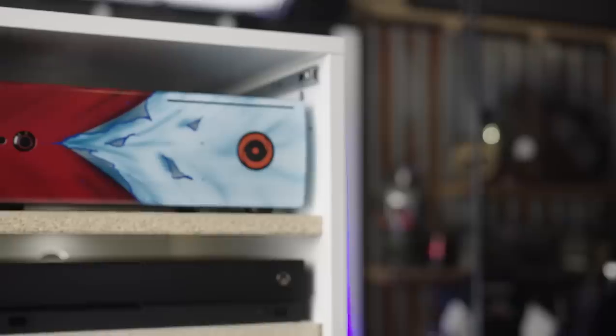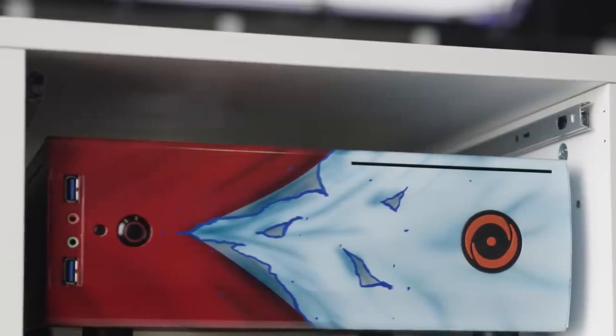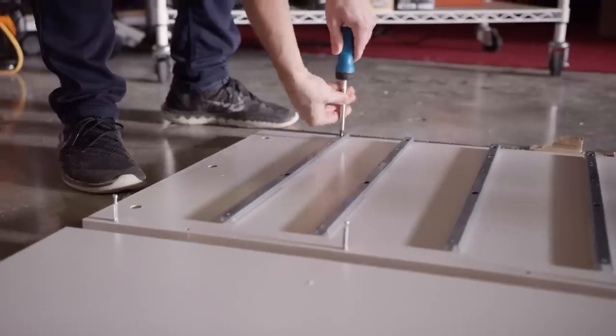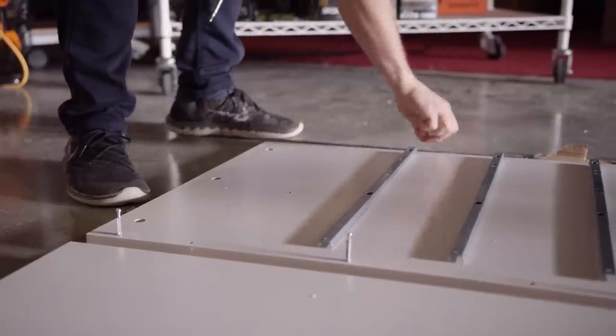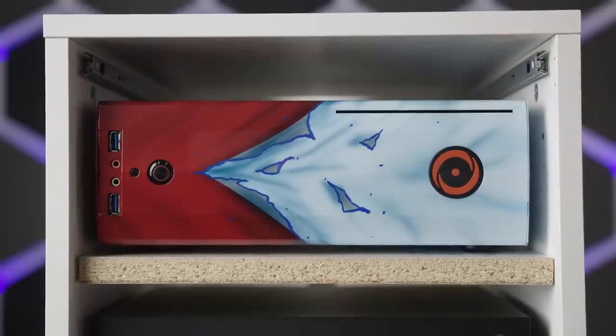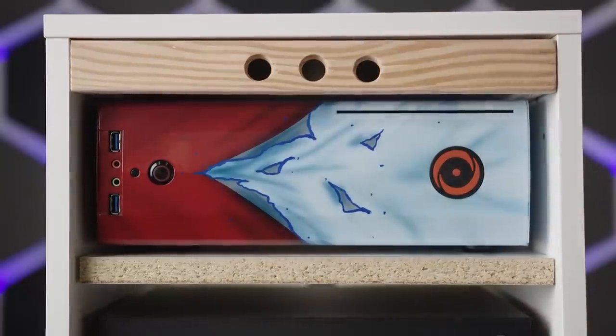But hold on — if there's so little space above the Kronos, where are all the switches and wiring going to go? There's a spare three and a half centimeters up there. This is not quite enough for a fourth shelf, given that the shelves themselves are almost two centimeters thick. But what if we salvaged some of our discarded cabinet pieces to make a custom, super low-profile drawer? We remounted our spare rails and Gorilla Glued a new facade that would hold our switches. Et voila — all the desk's hardware in a compartment no taller than the trim piece we were going to use anyway.